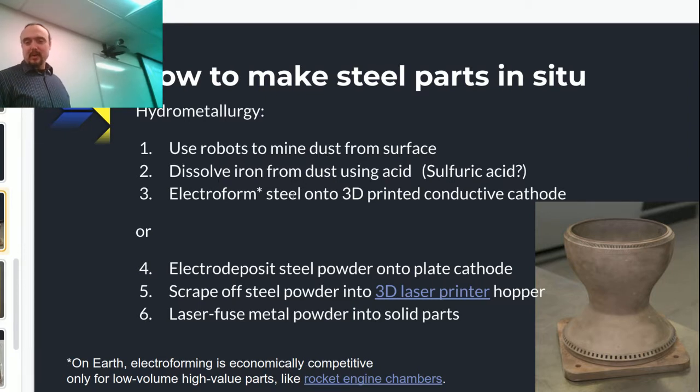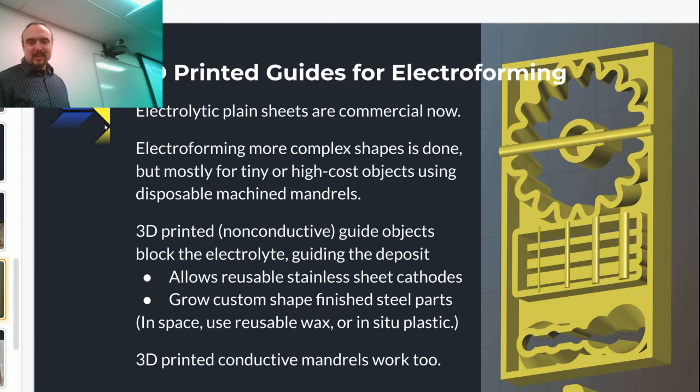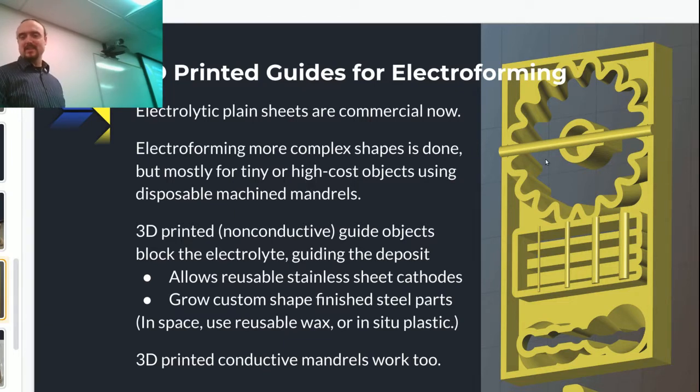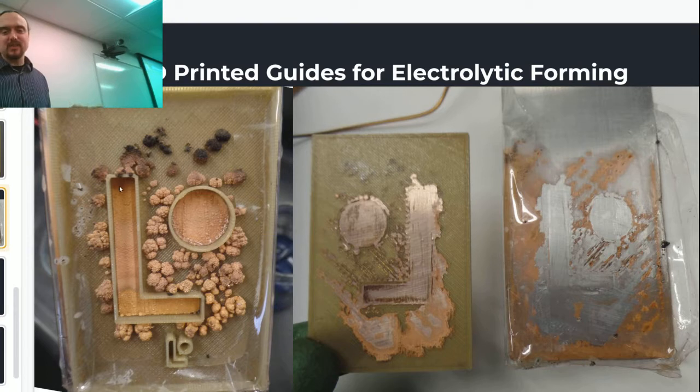So the idea is dust straight to an electroform. This is really easy to make sheets. As soon as I can electroform sheets of stuff, electrolytically refined copper is kind of the standard thing — copper is great for this. The copper doesn't really want to be oxidized — it's a lot more oxidation resistant — whereas steel just wants to rust. So these are some electroformed copper pieces, and on the edges you can actually see the layer lines where it had a 3D print — a non-conductive guide that just keeps the electrolyte from reaching certain parts of the deposit, so you can shape the deposit. This is a little L and O shape — I'm growing it onto a sheet of stainless and blocking parts of it. My 3D print apparently wasn't completely watertight because it started growing bizarre dendritic things on them.